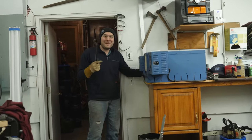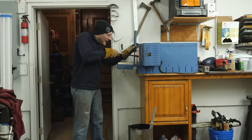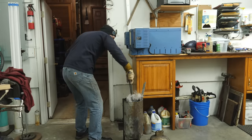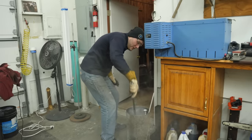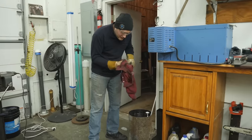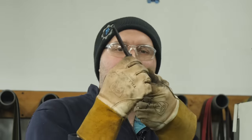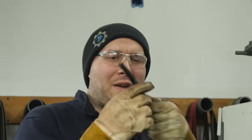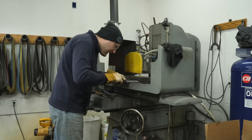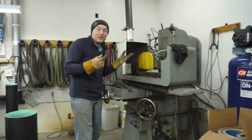The blade has been soaking for 10 minutes and the oil is 110 degrees — it's time to harden our blade. Pop it out, up and down, a lot. Nothing dramatic. Wipe it down with a T-shirt. The blade looks pretty nice; I don't think it warped at all. I check if it's hard with a chainsaw file — it's good and hard. I'm going to let the heat treating oven cool down and then temper this thing at maybe 410 or 415 degrees for a couple hours.